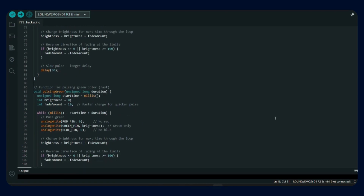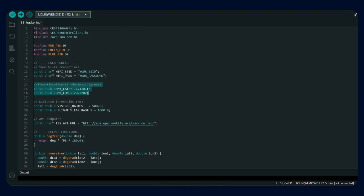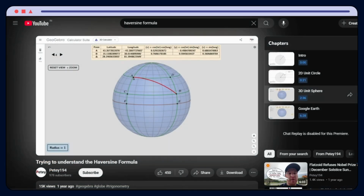That's it. However, I'd like to give a brief explanation of how it all works so you can tweak the setup as needed. We start with our current latitude and longitude set as constants in the code. We use the Open Notify API to retrieve the current latitude and longitude of the ISS in real time. To determine how far the ISS is from our location, we cannot simply subtract the coordinates because the Earth is spherical. So we use the Haversine formula, which accounts for the Earth's curvature to accurately calculate the distance. I won't delve too deeply into the mathematics here, but I've included a link to a great explainer video in the description for those who want to learn more.